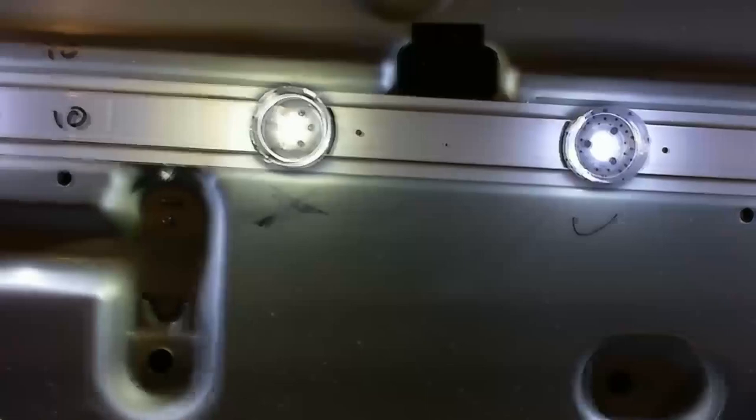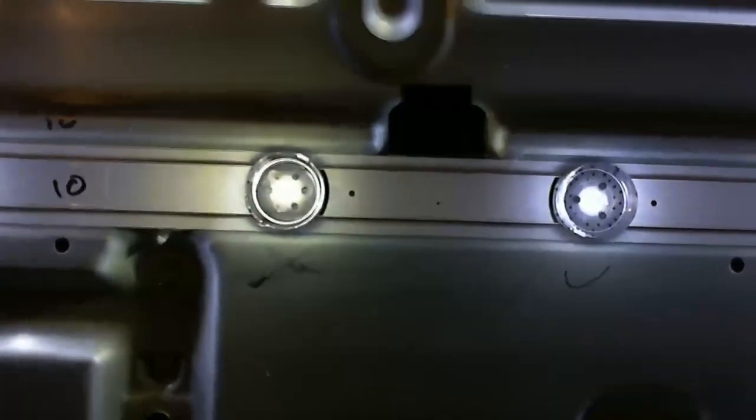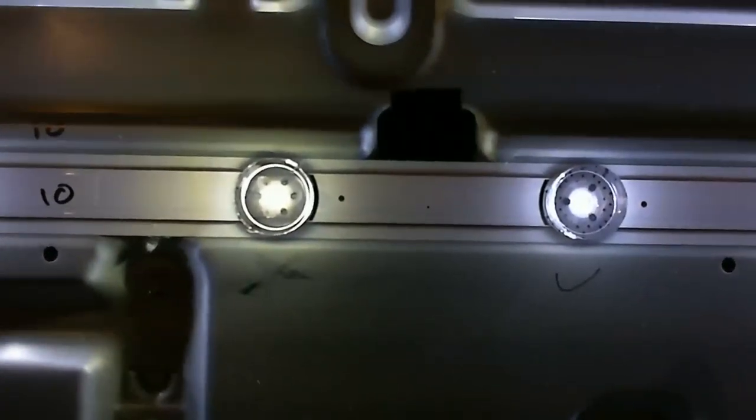The first thing we see when we test these LEDs again — it's like a little frosted lens. And of course it's the wrong color, it has a yellow tint. This one here is another diffuser sheet from another TV I had. Powering up the whole strip — it has 11 LEDs and each LED takes about 6 volts, so about 60 volts is good enough to light them up.